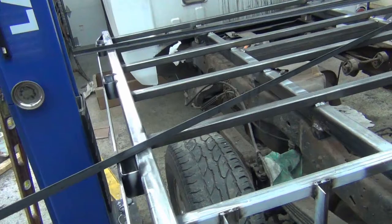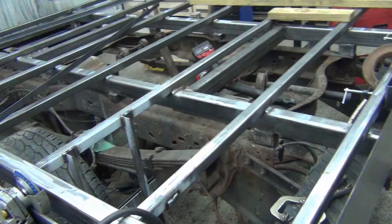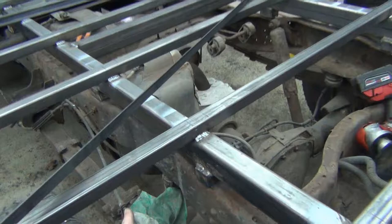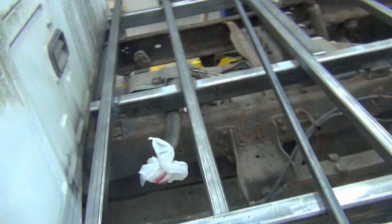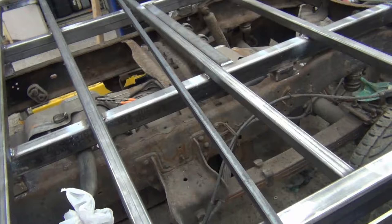because after that, if I get this front plate done and that stake pocket's done, I do have more welding. These tubes aren't welded all the way around. I may want to do some reinforcements, just stick some triangles here, just because of side loading, even though I don't think it'll be an issue, but I don't know. I stare at it and say, well, since I went so thin with the 2x on top, I want to make sure it's sturdy. And we do have 8 1.5 by 1.5 3/16 tubes here.